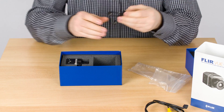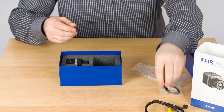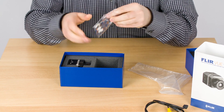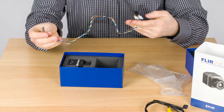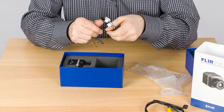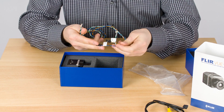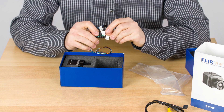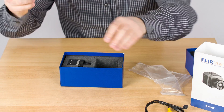This is a metal fabricated GoPro adapter for the thermal imaging camera. Last but not least we have the cable for the PWM connectors and the MAVLink. On the camera side we have a 7-pin Hi-Rose DF13 plug, and the opposite side is a 6-pin DF13 connector from Hi-Rose for Pixhawk compatible flight controllers. The first connector for telemetry occupies PWM 1 and 2, while the other two connectors for PWM 3 and 4 are basic receiver compatible plugs.